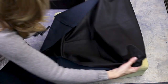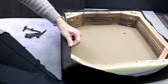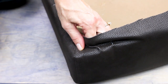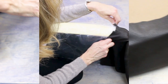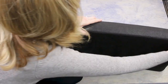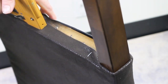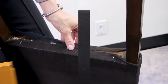Your sewing is done. Now pull the new covers tightly over the chair back and seat. Load a staple gun with staples and start on the seat piece. Start by stapling in each corner, then adding staples along the sides. When you get to the corner, fold the fabric all together and place several staples right in the corner. For the seat back, fold under the raw edge around the legs, then tightly staple the back side to the underside of the backrest. Overlap the front over the back and staple again, making sure to line up the leg openings with the opening in the backrest.